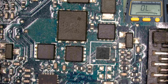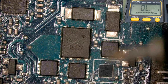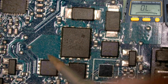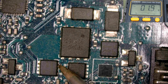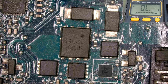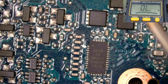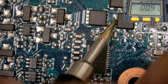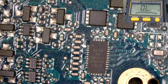Check this — this one is the primary MOSFET. And this one is the secondary MOSFET output — short circuit, showing one ohm. That's why the primary MOSFET is heating. I need to find out the short circuit. Again you can see this here — it's showing short, zero ohms. This is the problem.